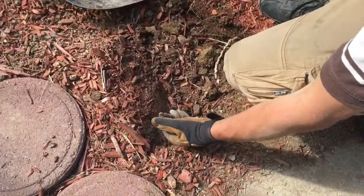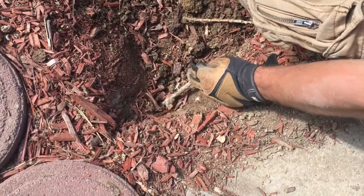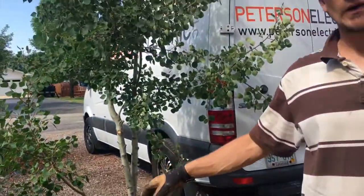I did turn this off, but I was literally sitting here welding with this back and forth with my gloves and a piece of bark, and I couldn't get the breaker to trip. That's called high impedance. This is an extension cord. My thought is they had a post light here with a photo eye to turn it on and off.